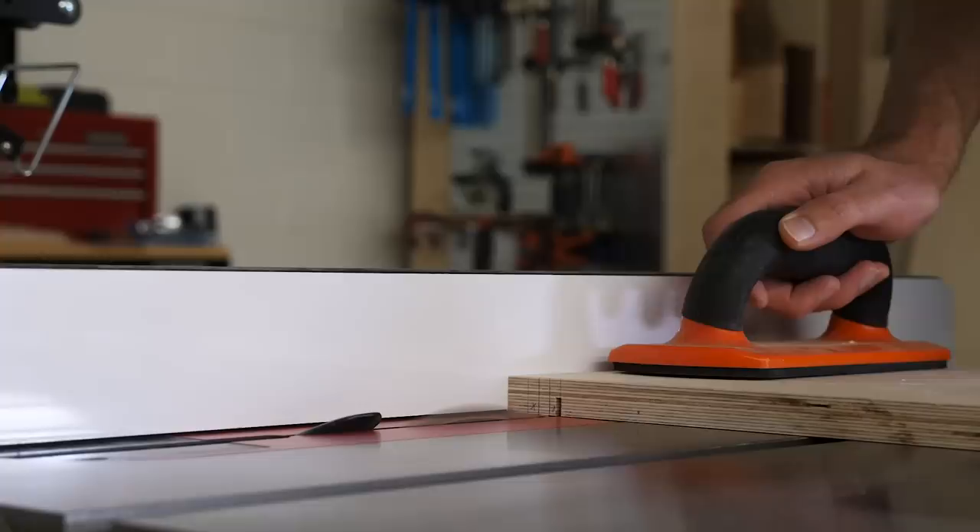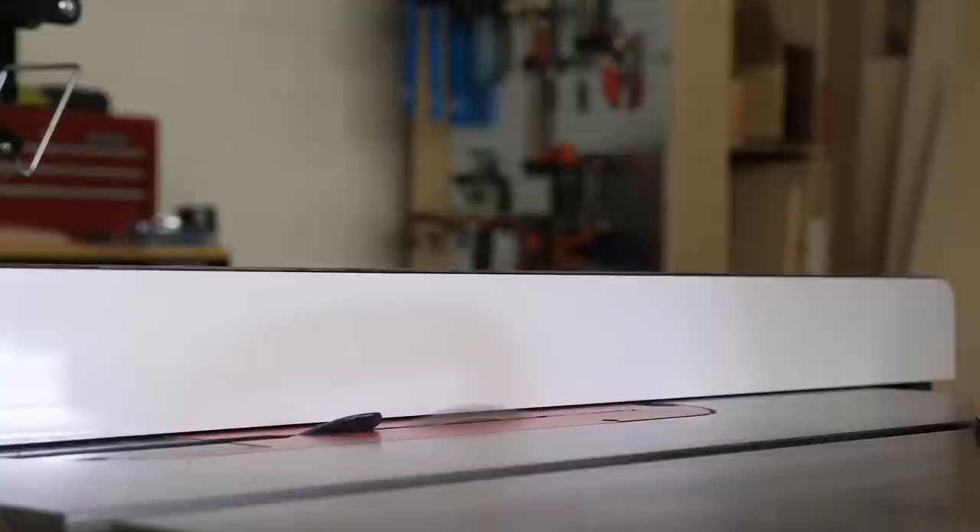Just to show it again: when you do sliding doors, you want to cut the grooves in the top a lot deeper than the bottom. That way you can lift your door up into place and insert or remove it.